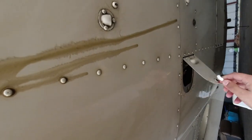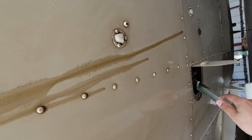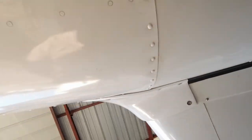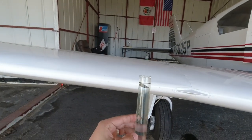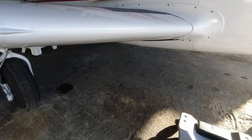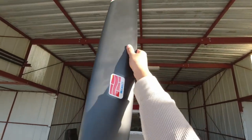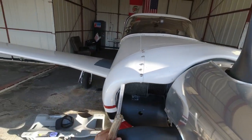Next, we're going to sample check the fuel. This is to make sure we don't have any fuel contamination or water in the belly. Just giving it one look around here — this is normal oil, by the way. Comanches are known to be a little leaky. Checking the fuel to make sure it's all blue. Aviation fuel is blue. If there's any water, it would sink to the bottom and you'd be able to see the difference. Next, we'll check the cowling on the other end. We're going to check the propeller, the alternator belt, making sure there are no big rock scratches. There's a propeller control cable. Tire — make sure it's nice and inflated properly.